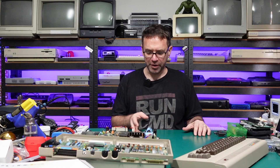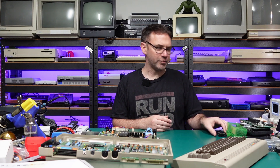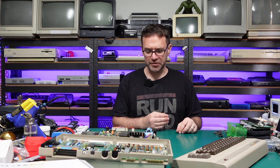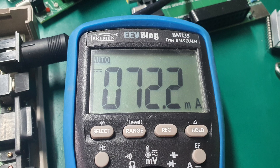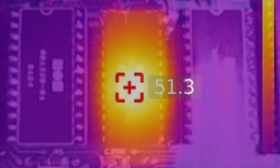All of these are a perfect drop-in replacement for the original ROMs, whether you've got a dead one that needs to be replaced, or you've got one of these fairly ugly EEPROMs in there, or perhaps you just want to lower the power consumption of the ROMs. On testing, these use about 5 milliamps at 5 volts, and the original ROMs usually use around 70 milliamps. So these use a lot less power and will run completely cold, unlike the original ROMs which get quite toasty in some machines.